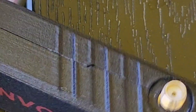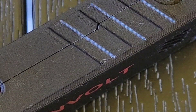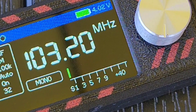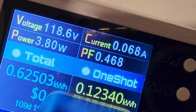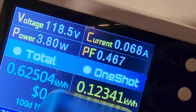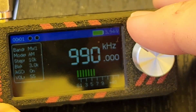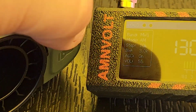Here's the USB-C, and of course that little embedded speaker — it's not bad, not going to blow you away, but it will definitely do the trick. The one thing I notice is the battery: it doesn't last very long, maybe three hours tops — take note of that. Drawing 0.068 of an amp while charging — minuscule at best — and it takes about two hours to get a full charge. Also take note: this little radio is subject to interference. There was a loud whining sound from a portable USB fan, but turning it off made that whining noise go away.